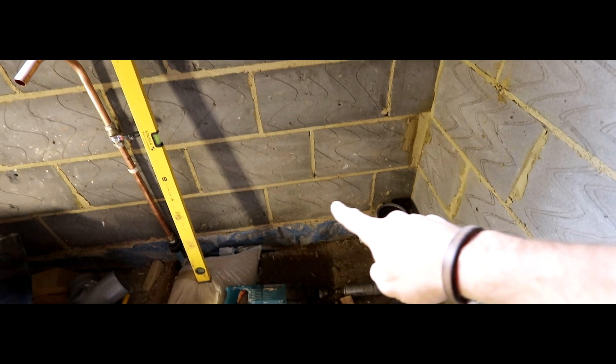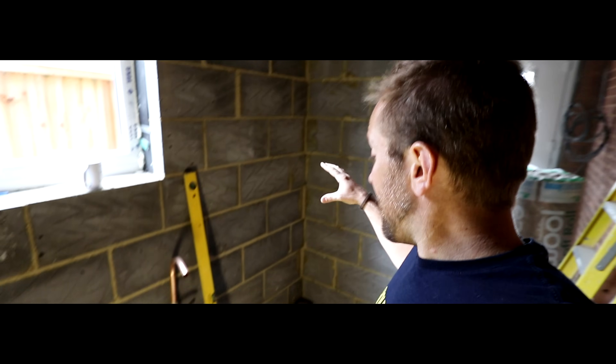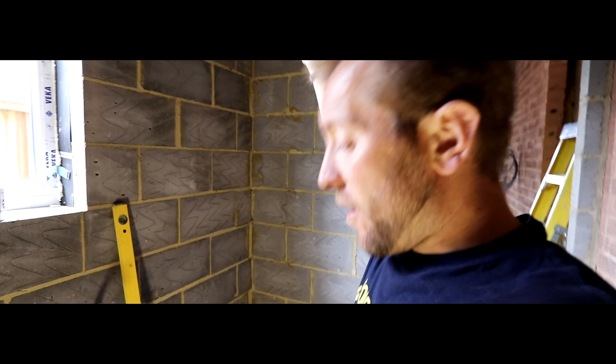I've got to put on a little bit of half-inch pipe ready to go up. On this side of the job we've got a wall-hung boiler up there and an underfloor heating manifold. I've got my inch-and-a-half pipe down there for the high-pressure relief for our pressurised system. We've also got a big unvented cylinder going in here and the high-pressure relief will be going there for that too. Today's video is nice and simple — just getting our four-inch stack up, 45 through.